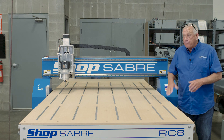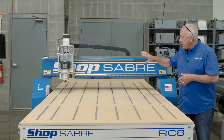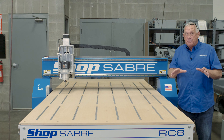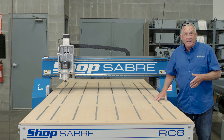There's an interesting note here: this table is bigger than 4x8 because we always make our machine tables oversized. The machine has enough travel so that table is actually machined on the machine itself. On a vacuum table, this means you don't have to have a gasket between your vacuum table and your spoil board, because the machine surface is so flat.